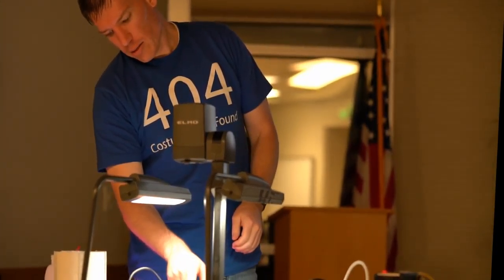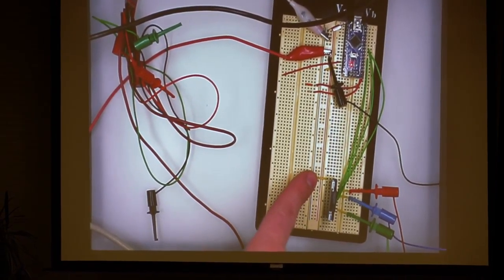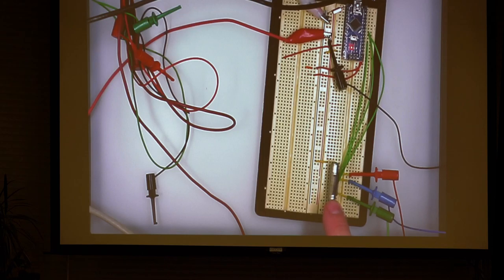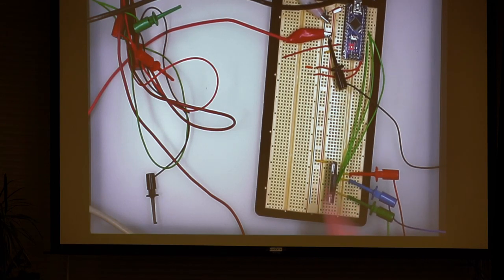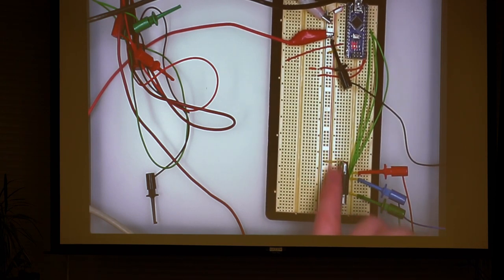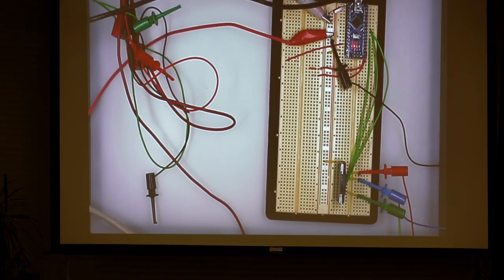By hitting the signal, the MOSFETs are going to then allow the current to run from the ground connection here back into ground, which is this little wire here, and continue on. The only difference between mine and Phil's is that this one is a FET array, so I've actually got 5 MOSFETs here that I can use, all just in one little package. I have to use a bunch of little smaller ones. Again, this has the little heat sink on the back. Right now it's completely cool, so I'm not super worried about it overheating, but if I were, then I could just, again, screw into these two poles with the heat sink and it would be fine.